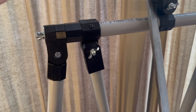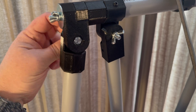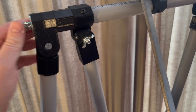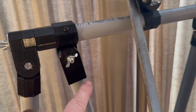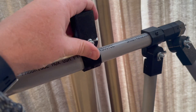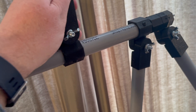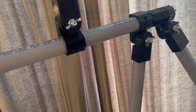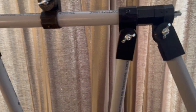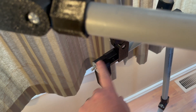Up here is the shoulder joint — I've got two designs, left and right. I'm going to include both of them, but in reality one goes for both; it just matters how you access the wing nut to readjust the arms. You can see how I've got the Allen bolt in to get this thing all locked up, same with the neck. This is the neck joint — once you've got this to where you need it, you drill through and lock this down exactly where you need it. If at a later point you need to do differently, pull out the bolt, realign, put in a new one. Done. Everything is still adjustable — all you do is put a few extra holes in the pipe. Same thing all the way down to here where it's two through joints to make the hip, and then two shoulder joints to set the whole thing up.